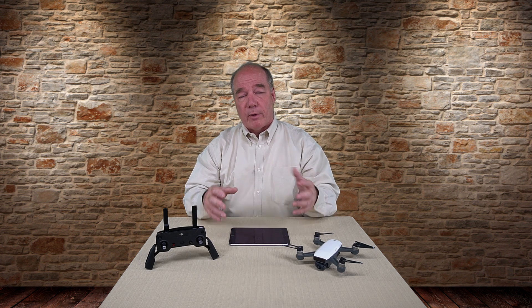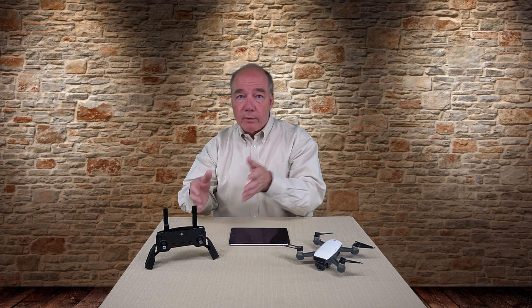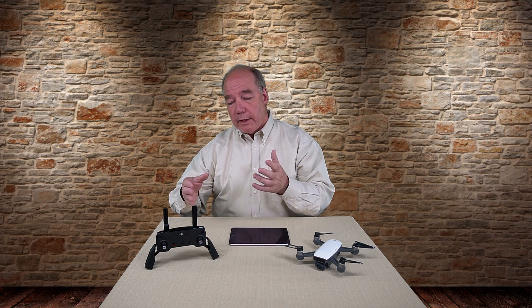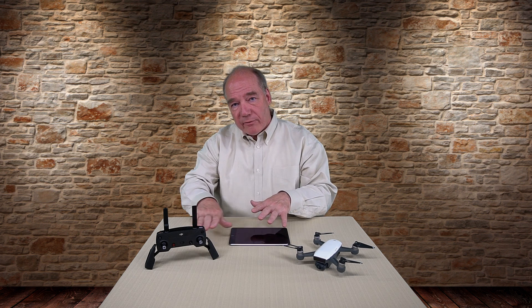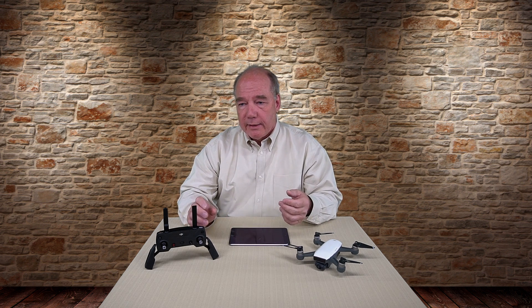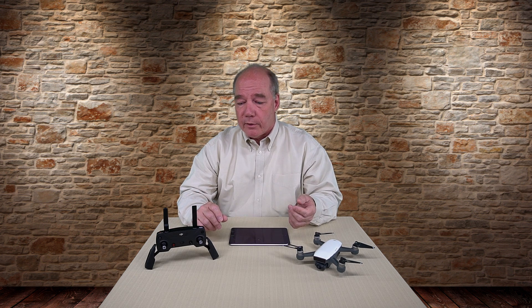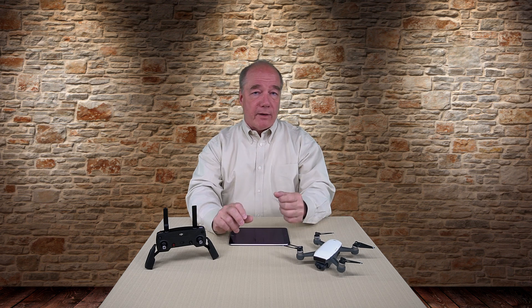This topology isn't very different from a lot of quads on the market. The Bebop 2, for example, is a pure Wi-Fi quad as well, and the remote controller works exactly the same way — you bind the remote with the quad, connect your phone to the remote, and the remote does the heavy lifting, transmitting telemetry, direction, and video streaming back to your tablet. In a lot of ways it's kind of like a Wi-Fi extender in your home — it has much higher output power plus directional antennas that throw most of the signal downfield toward the quad.